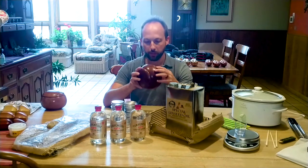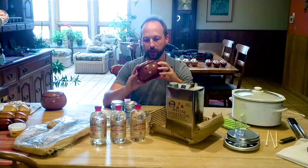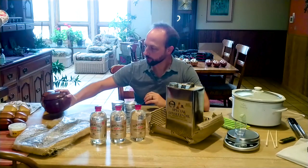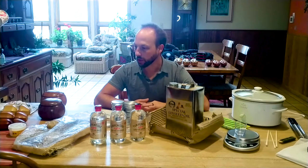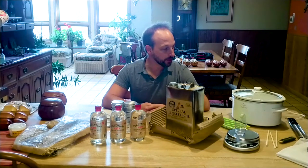So here's a piece of wood which, again, is pretty, but doesn't have that layer of lacquer. It's got a nice shiny finish, so I would guess that it has just been buffed with wax. You can use other things like Danish oil. Mineral oil is a petroleum product that a lot of people use on cutting boards. But what I intend to use is linseed oil.